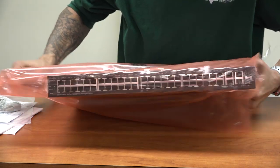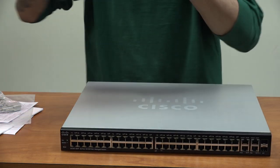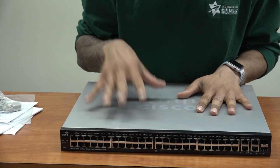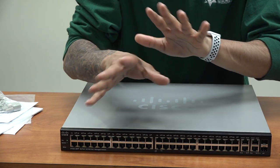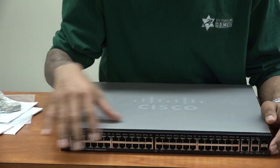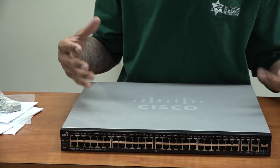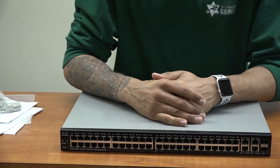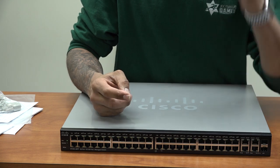Let's take this plastic off. Like I said, we got two of these — 48 ports each, so 48 plus 48 gives us enough ports. The first switch I already configured on a 10.10.10 subnet. This one I'm going to assign to an IP address on the 10.10.10 subnet as well, so that's the IP address range I'll be providing to my VoIP phones. Our major carrier is Mitel — I like the plugin they have which is integrated with Office 365 and Outlook.